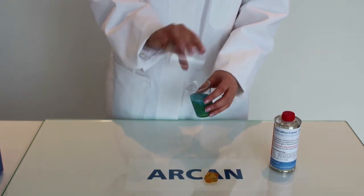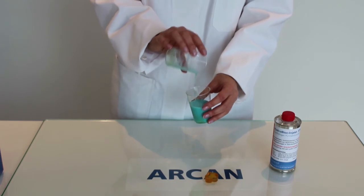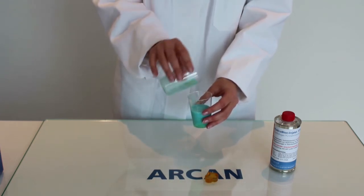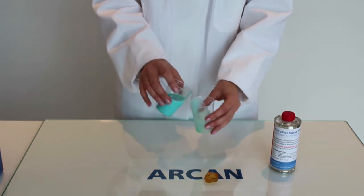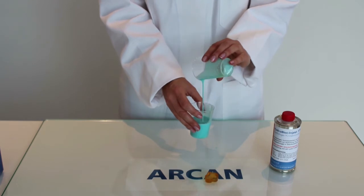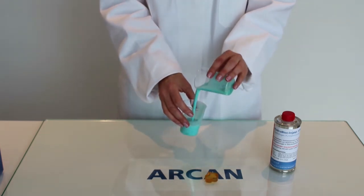It is fantastic how easily resin and test liquid are mixable. The same happens with water in the building structure. Integral Resins enclose a blocked hardener, which activates in contact with humidity — this starts the reaction and the curing process. More humidity leads to a faster reaction. Humidity is always available in building materials, sometimes more and sometimes less, but always enough for a safe and secure reaction.